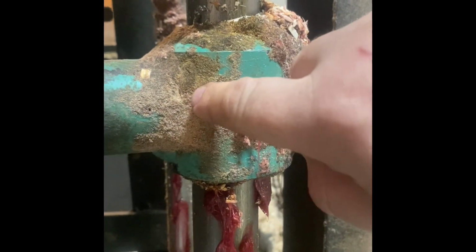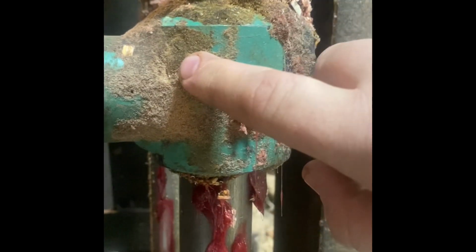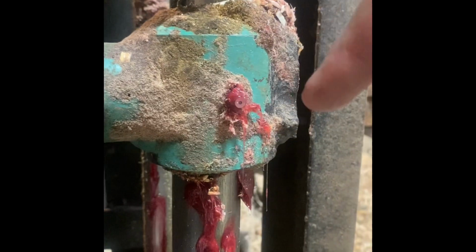These have a brass bushing, and it's spiraled inside of there, so the grease will come out. And then there's a brass bushing in here. And then these arms have a chrome shaft, so they don't, normal steel will get pitted too fast. And then those are the main bearings, top and bottom.